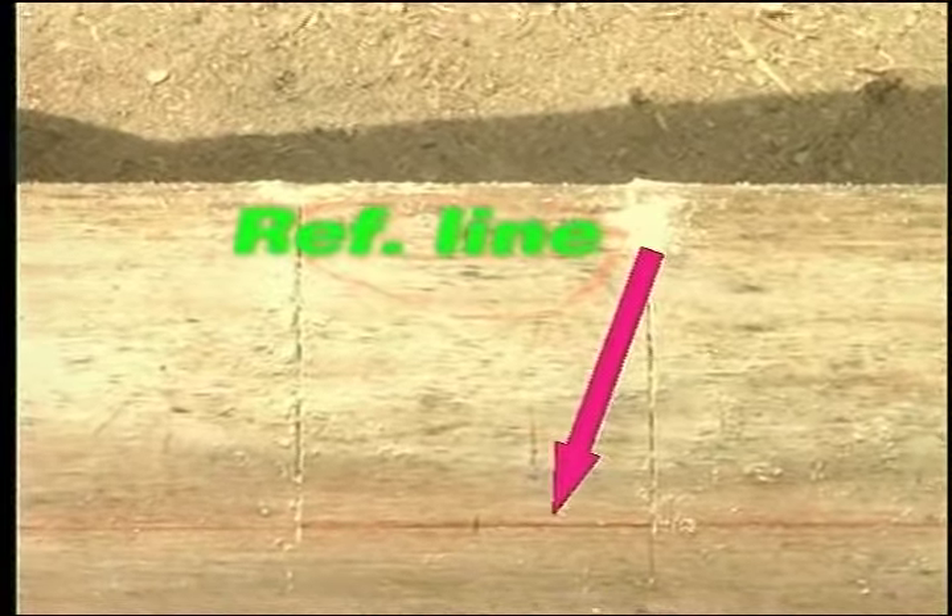In preparation for the common rafters, nail a strip of wood — one by four — to the top of the plate, purlin, and ridge logs that will lift the rafter the thickness of the ceiling material. This will greatly speed up and improve the quality of the ceiling application. Alternatively, this step might be rabbited into the beam before it is put in place. This will be a little stronger, but a lot more work.